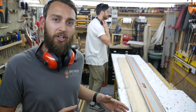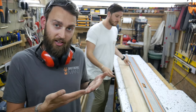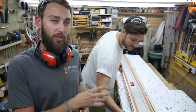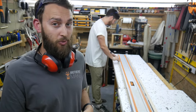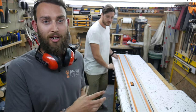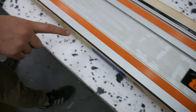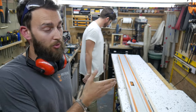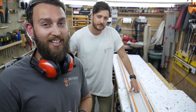These are the boards we're going to use for our table top. We need to make a little cut on each one so that we get a really nice tight join when we put our dowel joints in. We would actually use our table saw for this but we don't fully trust the boards to be completely square, so we're going to set up our track saw. If you look along the edge you can see how bowed these boards are - by doing it on the track saw we're guaranteed to get a nice square edge.